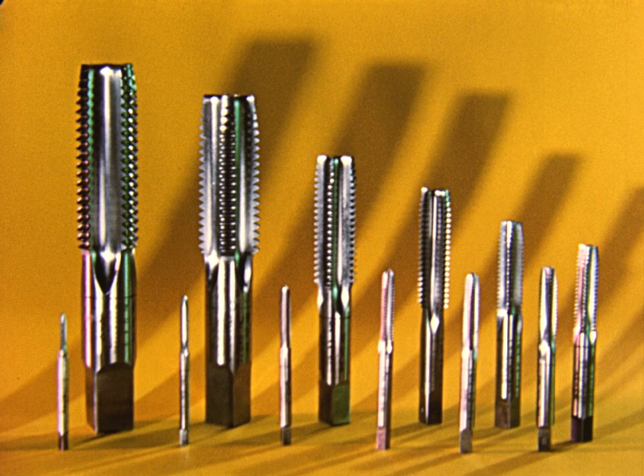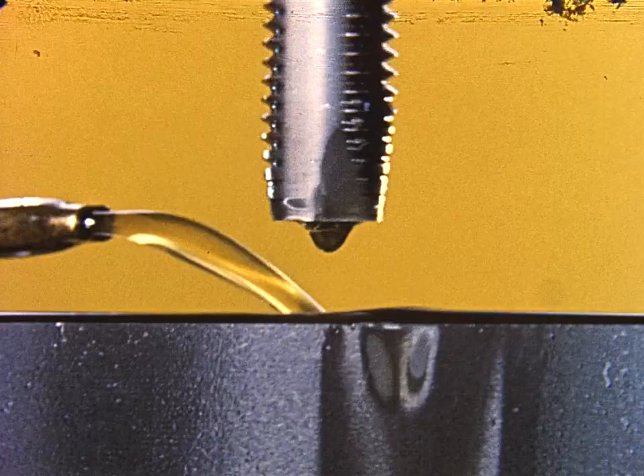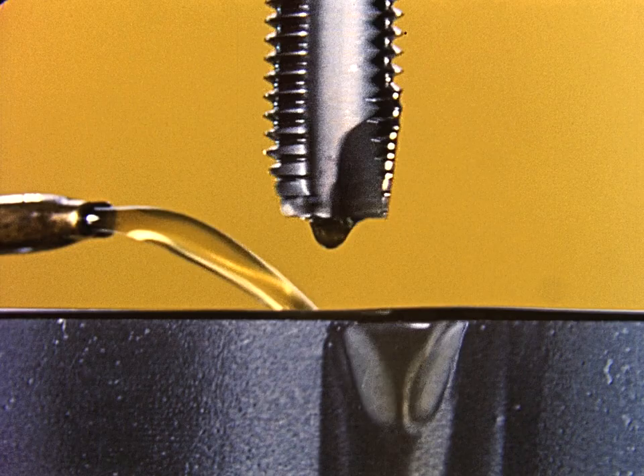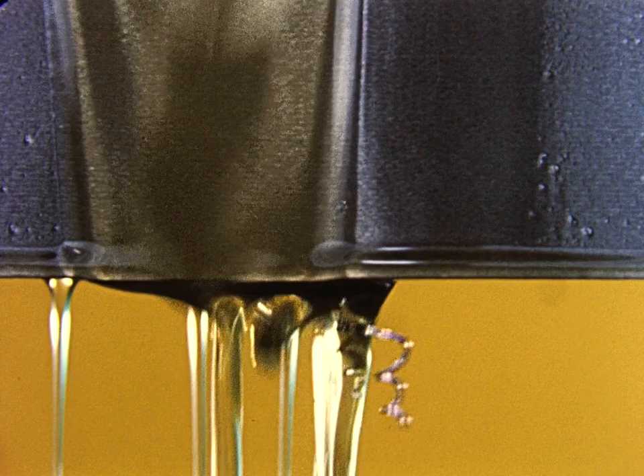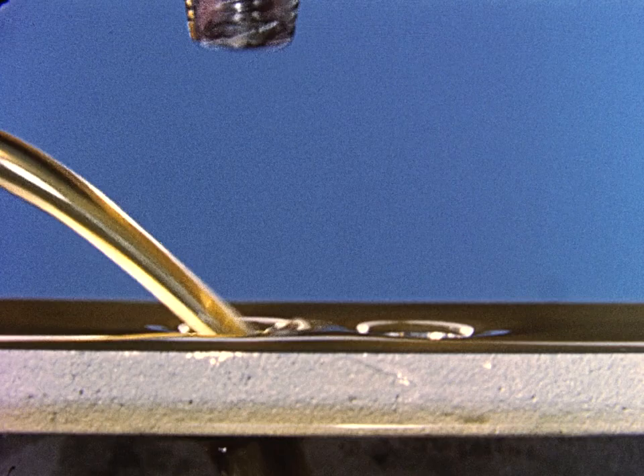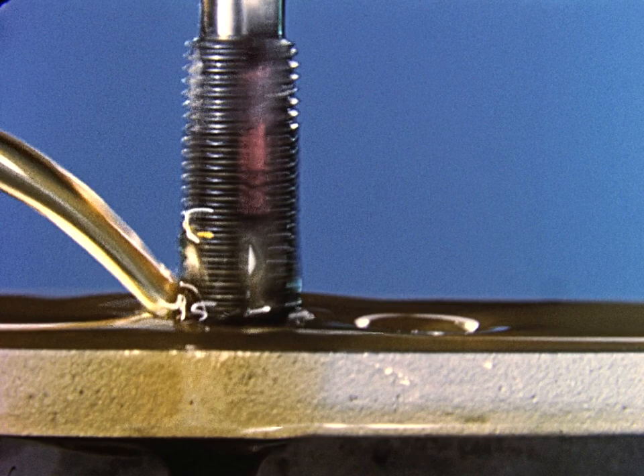We have seen how differences in materials will affect the choice of a tap for a given job. Now let's see the effects of improper tap selection. Improper selection is, of course, one of the most common causes of tapping troubles. For example, a plug tap may have been selected for tapping a hole deeper than twice its diameter when a gun tap would do a much better job. Here is another example where a cut thread tap is being used — the threads are all right for a cut thread tap, but the designer asked for tolerances which cannot be maintained by this type. A ground thread tap should have been selected for this job. Ground thread taps are threaded after hardening and consequently have greater accuracy. Another common tapping trouble is found in faulty machine conditions. Any misalignment of the tap with the drilled hole will result in bell-mouthed holes or a broken tap.